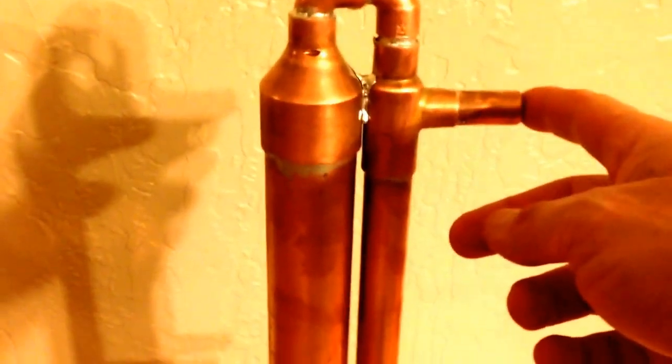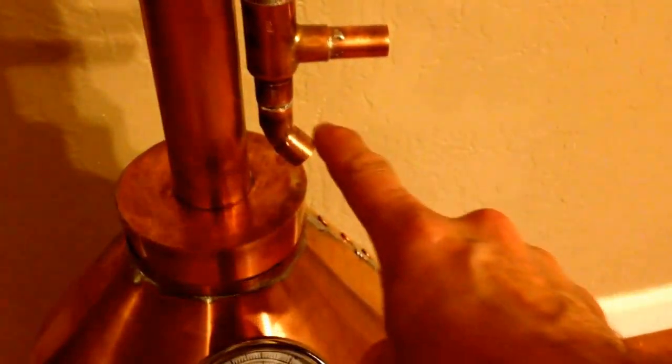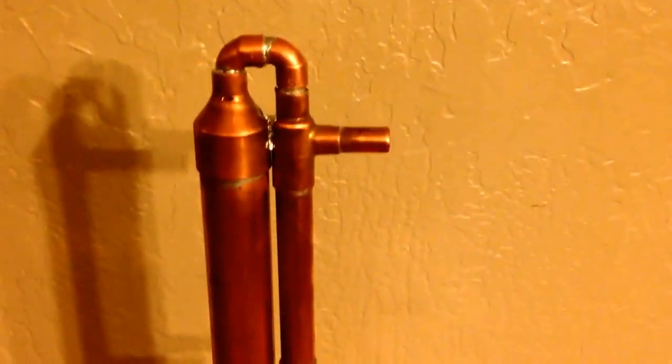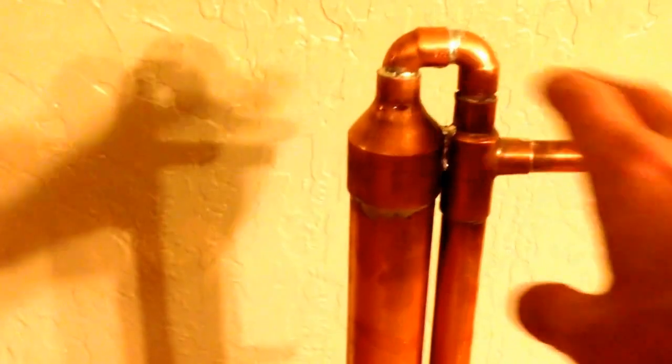You have your cold water going in here and coming out here. This right here runs straight through, and I still need to put on my last drip tube down there — I need to cut that to length but I'm going to wait until I get my hot plate. Your vapors come up here and you have cold water coming in, which is a jacket around the vapor tube, so this will cool it down and condense the alcohol back to a liquid and then drip out.